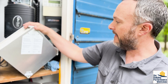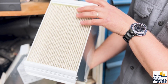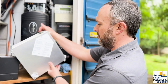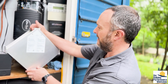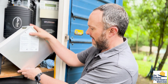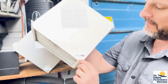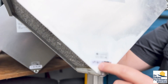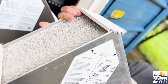This is the brand new core that we're going to be putting into this ERV. An ERV has a paper or a composite core. An HRV has a metal or a plastic core. You can see the gasket here that's going to provide air tightness all over the thing, and it's got instructions on it. This is the old core. You can see that it's showing its age — this is corrosion from moisture, and this is signs of condensation.